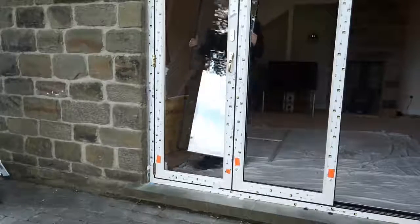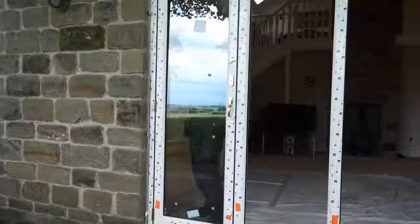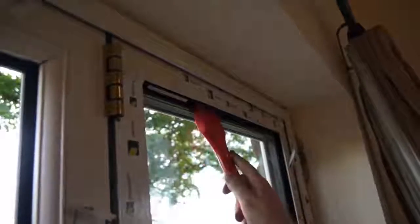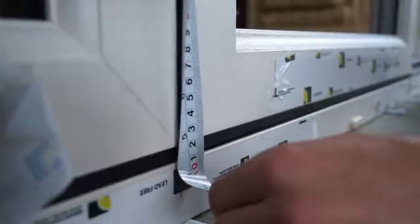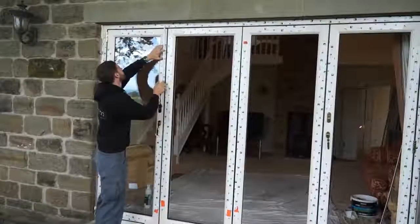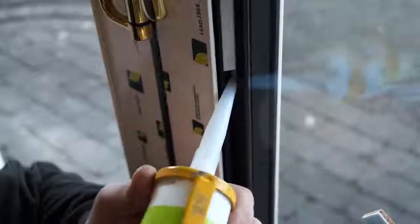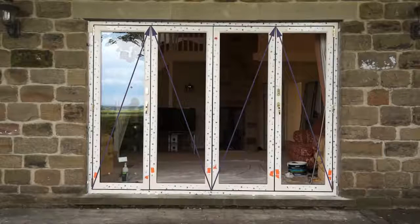Lift the glass onto the linear glazing platforms from the inside and pack as required. All sashes should be toe and heeled to maintain equal and parallel gaps on the head and the threshold. Add silicone between each vertical platform to help keep them in place. A full toe and heeling guide can be found within the Alumina bifolding door installation guide.